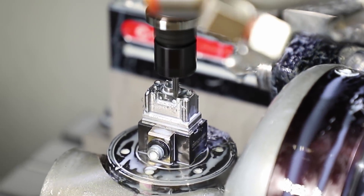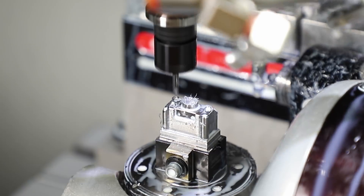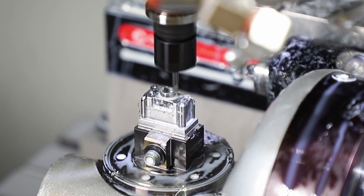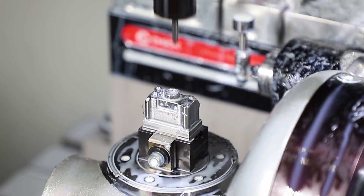Are they typically hogging from billet, or are they near-net shapes? Most of the time it's from billet. On a dental part, for example, when they're creating a full denture, it goes from a billet — they leave about 20 to 30 thousandths holding per side so they can come in and cut those off. So there is roughing. And there's a lot of roughing especially in medical parts or jewelry, where the finish is really important. The speed and RPM of the machine, and the speed of the rotary and trunnion, all come into play to get a finished part.